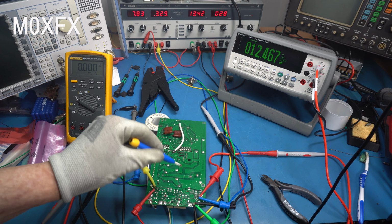And I've done something that I wouldn't normally do. I've made a modification. And if we look at it now, obviously we're in receive mode, and if we put it into transmit, you can see this comes down to 25 millivolts, really low. That's just basically noise. So that's switching correctly now. Now, obviously with these pre-bias switching transistors, they're basically digital transistors. They're supposed to be on or off. They're not supposed to be slightly biased on, because I don't think it's going to do them any good, if I'm honest, because they're not designed for power dissipation in that way. But yeah, it is what it is.